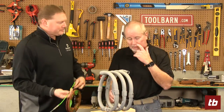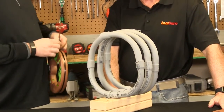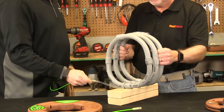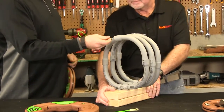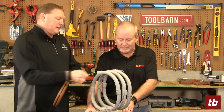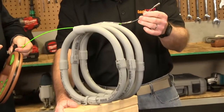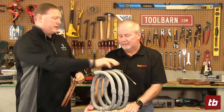Let me show you how that works. You're not going to find too many installations like this — they'd be in trouble with OSHA and the electrical board — but this is 12x90s, and we do this to show just how easily this will push through. Any electrician that has ever had to do fish tape can see how easily I am doing this. And there it is out the other end. Wow — just simple and easy. I dare anybody else to try to come up with something that can do 12x90s. Even fiberglass won't go through 12x90s like this.